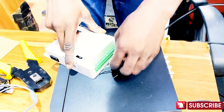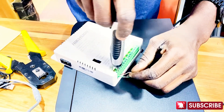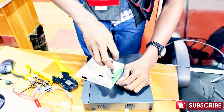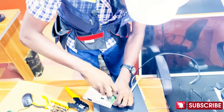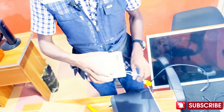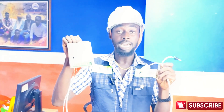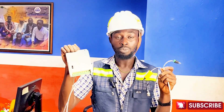Try to pull it out — if it holds, it is fixed. For the positive, always check the labeling on the terminal. When you buy a power supply, make sure to test it: when you turn it on, you will see lights come on, showing all ports are working. You can see here — whatever we did to A, we did the same to B. Whether you have 8 or 16 cameras, this is the same process. Try your best to make sure it is done consistently.